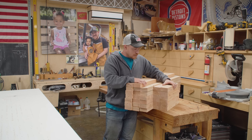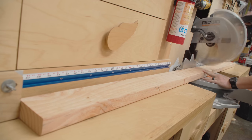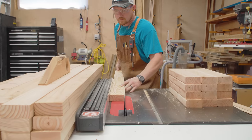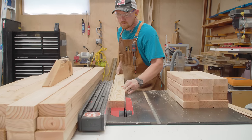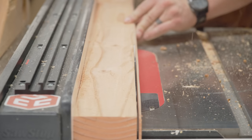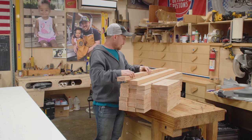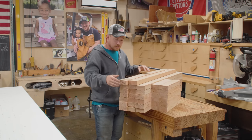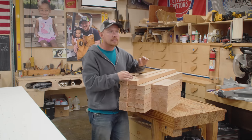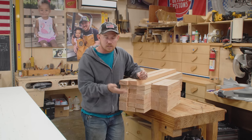What I have here is a bunch of two-by-fours that I've already slightly processed. I've cross-cut them to their final length at the miter saw and then ripped them to three inches in width at the table saw — one cut at three and a quarter inches and one cut at three inches to remove all the rounded edges. I did not joint and plane the wide faces, so these boards have a little bit of cup, bow, or twist, but I think I can clamp them down to the CNC machine tight enough to complete this experiment.